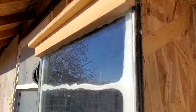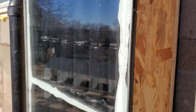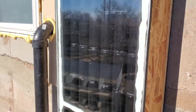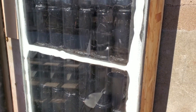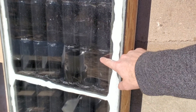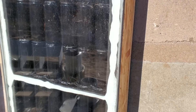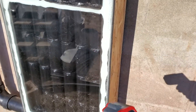You can see how I did the white caulk — I caulked in between each set of manifolds here, and here's the other one right here, caulked here. What this does is it prevents air from traveling between the spaces except inside the tube, so all of the heat transfer happens within each tube filled with air. I don't have any of the pop cans touching the glass because I don't want any heat to be lost through the glass. The glass is warm to the touch.